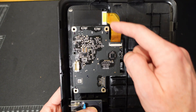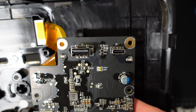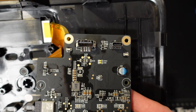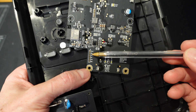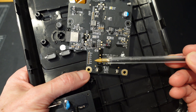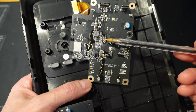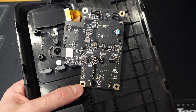Quick look at the back of the front panel. We have a display up here with a ribbon cable connecting to the main control board, and you can see our USB-A and USB-C connectors — surface mount connectors. This right here is our Bluetooth module. Then we have a series of header pins here with some voltage RX/TX communications pins, so perhaps this is how they are programming this board. Makes me wonder if there's anything we can actually do with this board outside the power station.